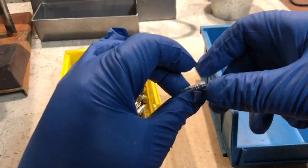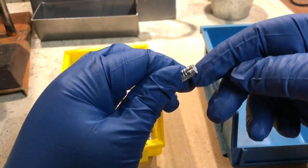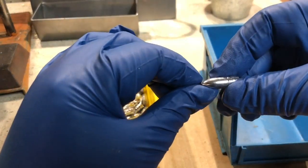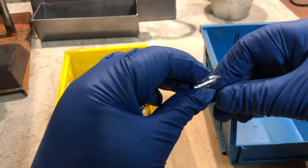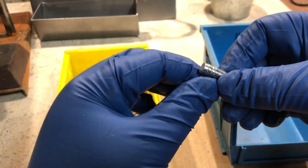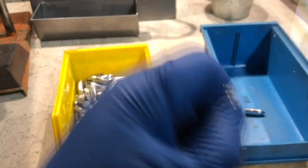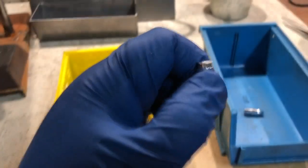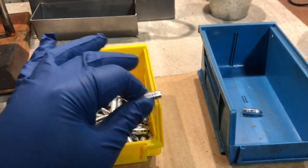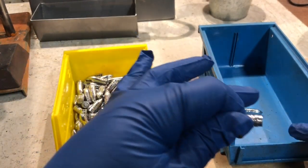Let's get started with the QC process. My QC process is to look at each and every bullet one at a time and make sure that, besides a little bit of ghosting, there are no defects and no rough edges. Gloves are great for picking that out. This one here has a slight burr on the edge and I can usually get that burr off with a flick of my bare pliers. That piece is now gone and I now have a nice smooth flat-base bullet and we're ready to go.